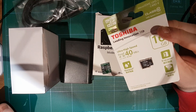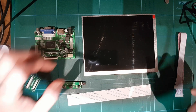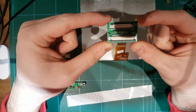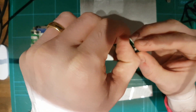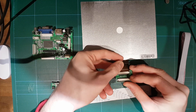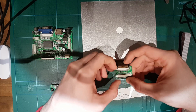I'm gonna be flashing my trusty base image on this 16 GB card and we'll also test the screen before we put it into the arcade cabinet. Time to put the screen together. The screen has a flex cable on the back which is a smaller connector, so this connector bit has a large ribbon cable connector and a smaller connector. Be very careful when dealing with these ribbon cables because they are very fragile — just use gentle pressure on the clips.